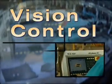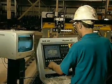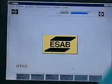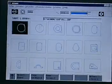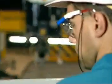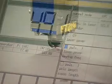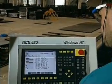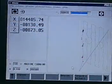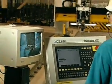ALPHAREX is equipped with ESAB's 5-axis Vision NT control and ESAB's exclusive process parameter programming. This unique feature provides automatic access to a whole range of laser cutting parameters, making it exceptionally easy to set laser station, laser power, and cutting gas parameters to produce an optimum cut. ESAB's active automation and laser nesting software provide optimum nesting capabilities, as well as remote control and monitoring of the laser cutting process for maximum productivity and plate utilization.